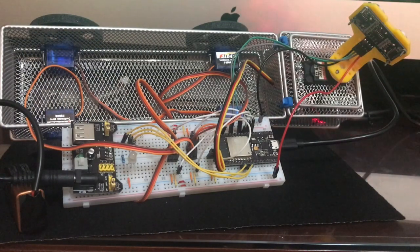The prototype is made of two wire baskets with four servos and connected wheels to move the robot, and a fifth servo to turn the ultrasound sensor. All servos and the sensor are controlled by a single ESP32. During development, the ESP32 is powered by the serial cable connected to the iMac. The servos and sensor are powered by a 9-volt battery connected to a power regulator on the breadboard. An LED is connected to the ESP32 to identify the status of the Wi-Fi MQTT connection with the Raspberry Pi access point.